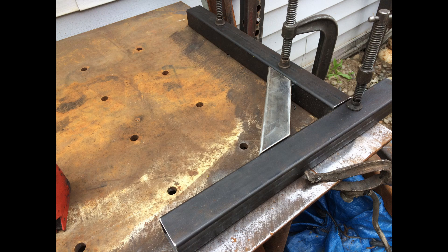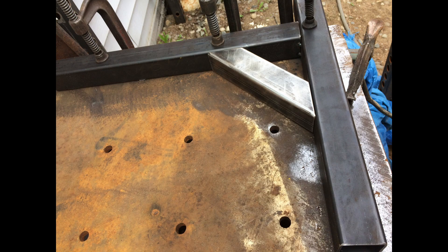With only a 16-inch tube, that brake is going to be about 30 inches tall depending on the casters you use. With the casters I've used — which are five and a half inches from the floor to the top — you'd still only end up with something 30 inches tall, and to me that's awful short. So I've extended them to 21 and a half inches. You'll have to adjust them accordingly to what's going to work well for you and your height.